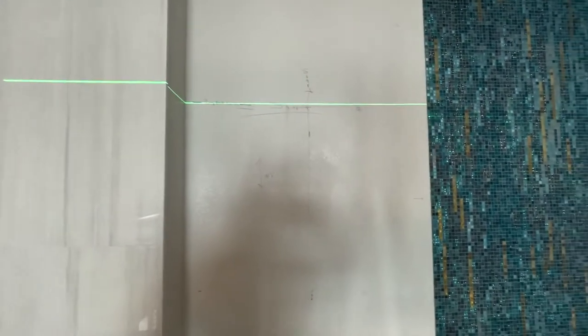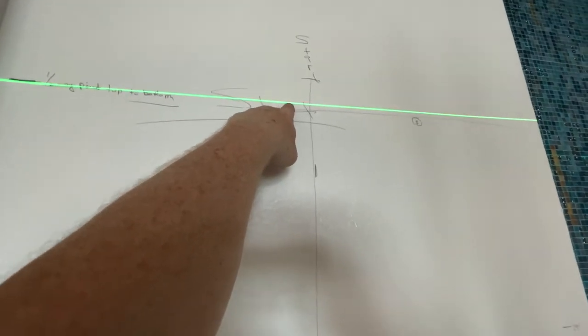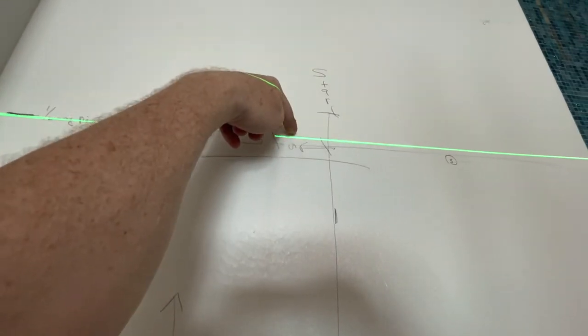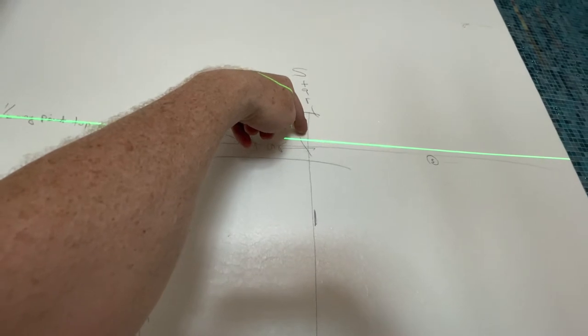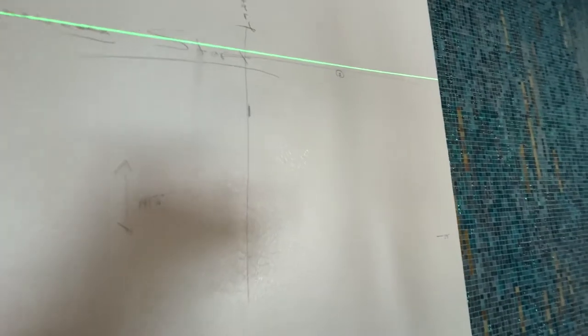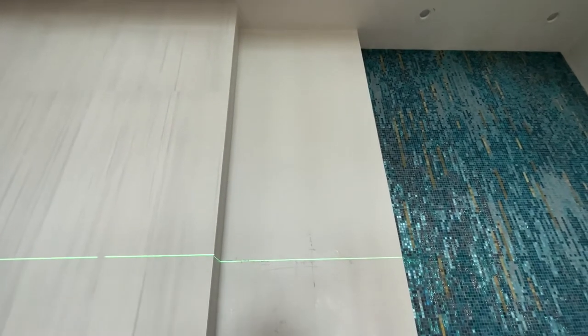I will begin my installation with the edge of my first sheet on this side of the green and my second sheet edge starting right above the green line, so that when I'm done installing my tiles 29 by 29 inches, I will have an even number at the bottom as I do at the top, without detriment to the beauty of symmetry.